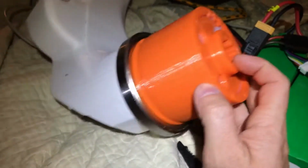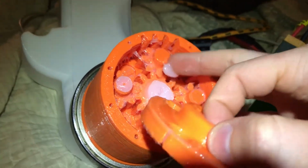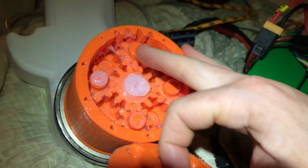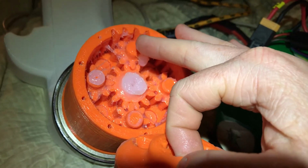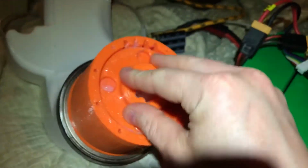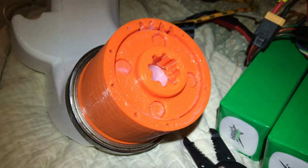And then, yes, the other thing I was going to say was these are 14 millimeter diameter 3D printed plastic pins coming out of the planets right here. And the pins failed in the previous videos. So I've looked at McMaster, and it's relatively affordable to get some alloy steel dowel pins that would go in these, and instead of printing the gears with a boss coming out of them, I could print them with a bore and stick a pin in there, and have steel pins coming into here, which would be extreme. The pins are very smooth, so there'd be less friction, and they're very hard, so they're not going to wear away. And I think it would dramatically improve the life of this gearbox if we do continue to run into problems with the printed pins.